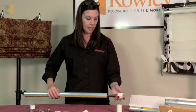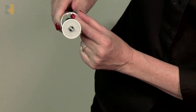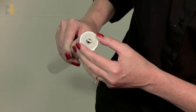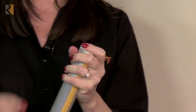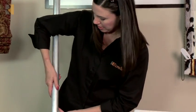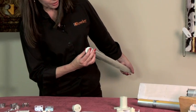You're going to put the spring end in and line up the top groove with the groove on the aluminum tube. You'll cut these tubes with a hacksaw or on an electric miter saw. Push it in firmly — if it's a little tight, don't hammer it; you don't want to damage the pin. Sometimes you can push it against the table to get it in. Then put the end plug in the other end, which also has a groove that lines up with the groove inside the roller.